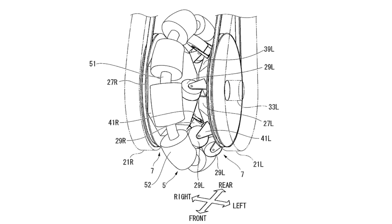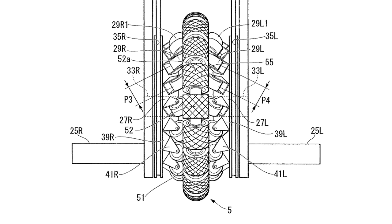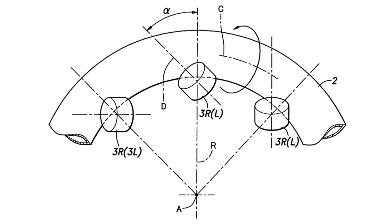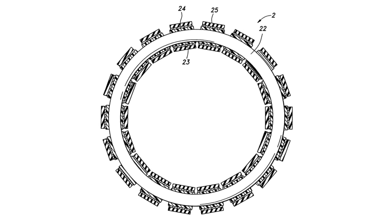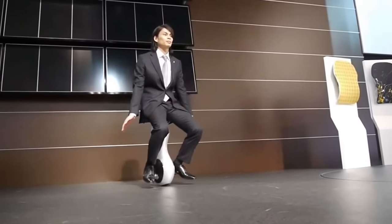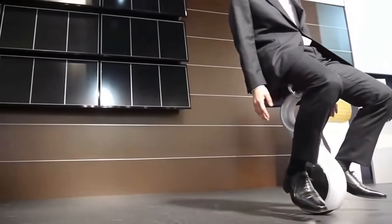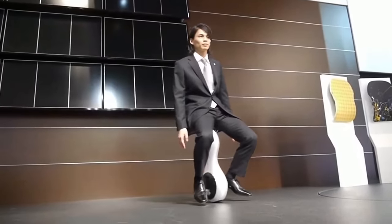So it looks like a very similar mechanism, but what's actually inside is quite interesting. I found the Honda patent for this — in fact the drive is based on a series of rollers mounted at an angle binding on the small output wheels around the circumference of the big wheel. Each hub on either side of the wheel has a mirrored set of these rollers and each hub is powered to make up the two components of the differential drive. There are more rollers on each of the two driven hubs than there are output wheels around the main circumference, so there's never a situation where all the hub rollers are in between the output wheels. The output wheels are mounted on a flexible shaft around the circumference, so they all rotate in unison, and that also appears to be all that's holding them in place. This part is going to be quite tricky to reproduce because we need something with high torsion resistance which is also not stretchy so our output wheels stay in place, and at the same time flexes freely so it doesn't cause too much friction.